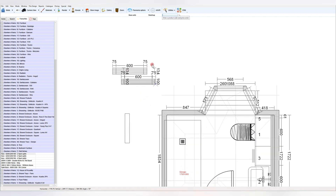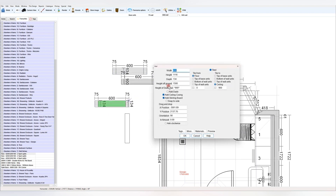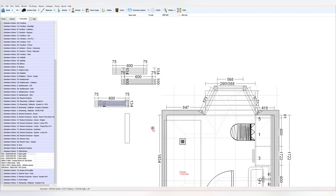This method still requires the utilisation of the internal walls to create the bottom and the sides, and then this object sits in the middle. I've oversized it by 10mm all the way around to allow for the 300mm and 600mm internal, so it's 320mm and 620mm respectively, including the trims on the left, right, top and bottom.